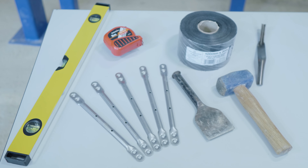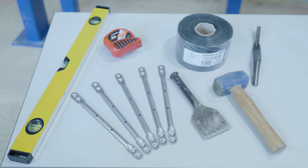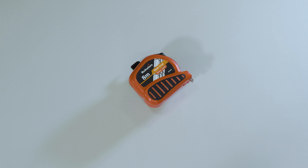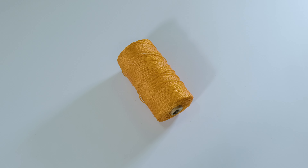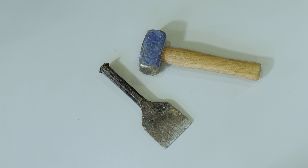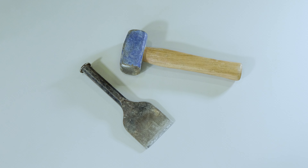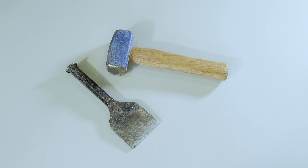Here's a quick run-over of the equipment we'll use today. Every bricklayer's tool bag should contain levels — ideally a 600mm and a 1200mm — a tape measure, either standard or one with gauging already marked on it, an 11-inch Marshalltown trowel, a string line, and a jointing iron. You'll also need a hammer and bolster for cutting blocks and bricks manually, though other cutting methods like a block cutter, block splitter, table saw, clipper saw, or angle grinder can also be used.